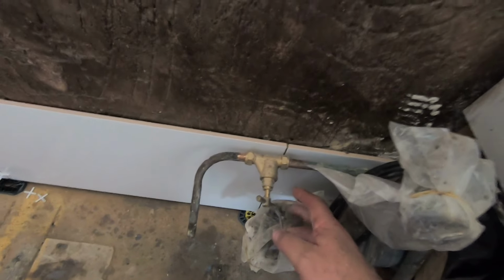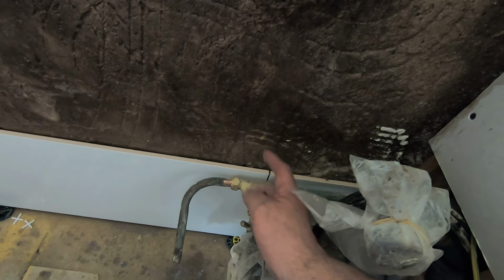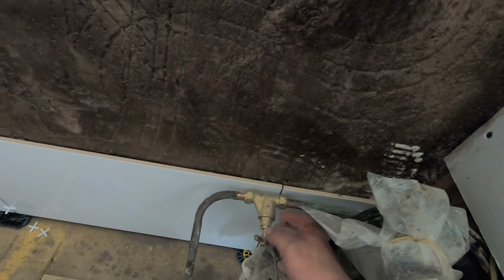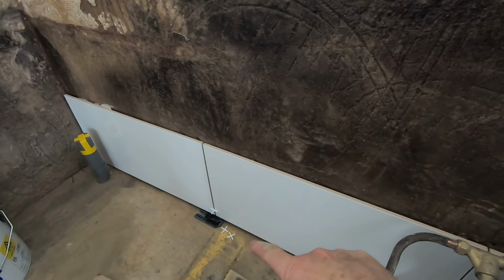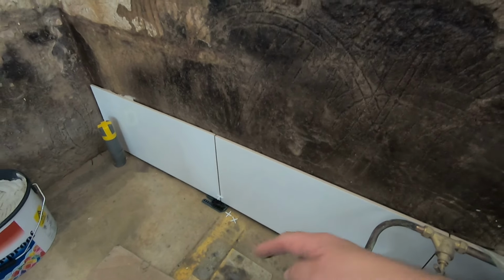And let me show you another thing. Where the water main is here, this is a good example. This is just hanging in midair and it needs to all be clipped onto the wall. But if I'd have clipped it onto the wall here on the concrete, I wouldn't be able to tile around it, or I would have to tile around it, which would be a really horrible job. So I'm going to put all the tiling up first on this wall. And then I can fit all the pipework to it, because from the boiler, which is going to be up there, there's going to be quite a few runs coming all down here, down to this piece here, which is going to be the channel for the hot and cold and the central heating to the other part of the flat.